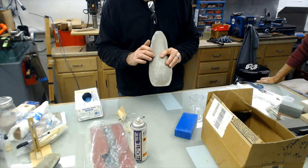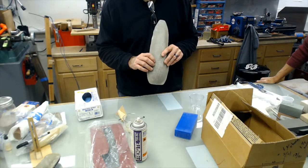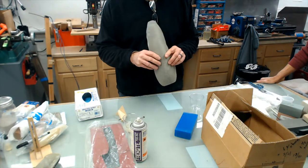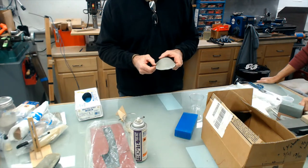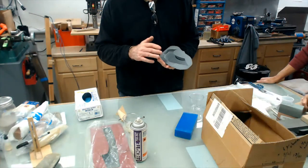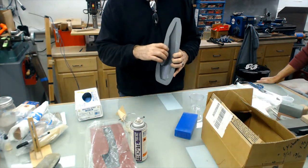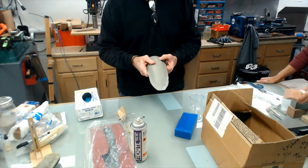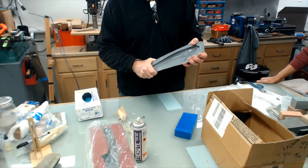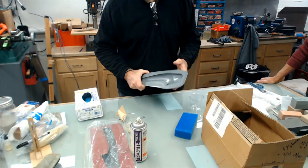It's about an eighth inch, quarter inch, and then between these four layers of glass there's tooling board that I formed up out of DT081. So four layers of glass, barely an eighth inch thick, if that. But the thickness was built up with the tooling board paste-type stuff. In some areas it's at least 3/8 or quarter inch all around. And what that does is give you a super rigid tool with a lot of support.